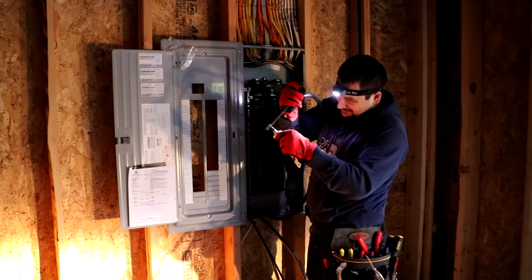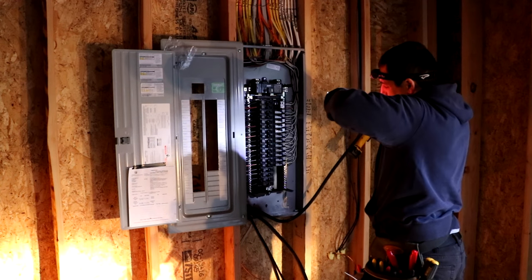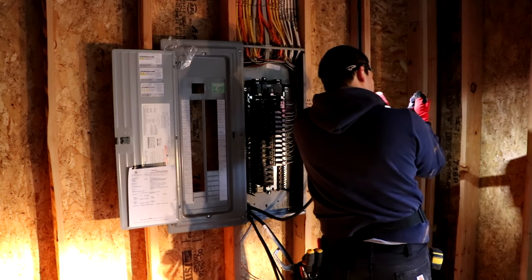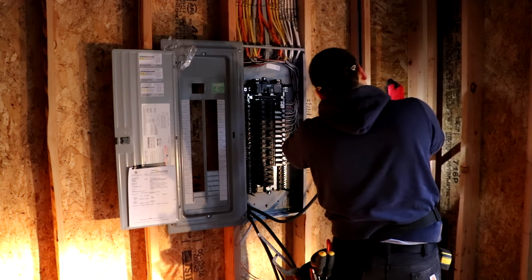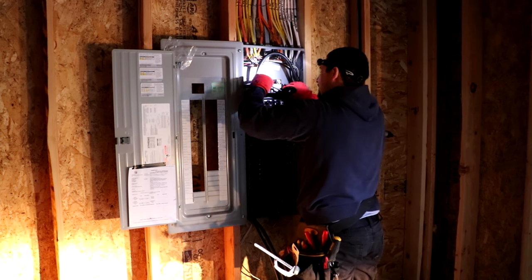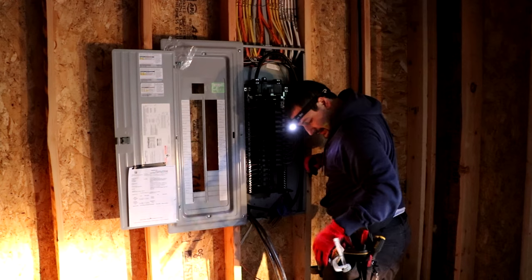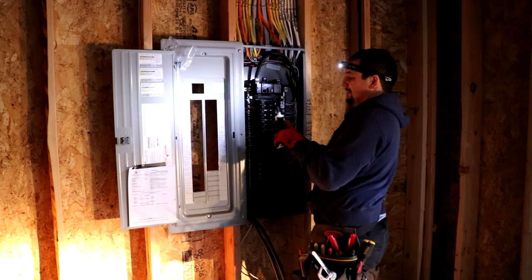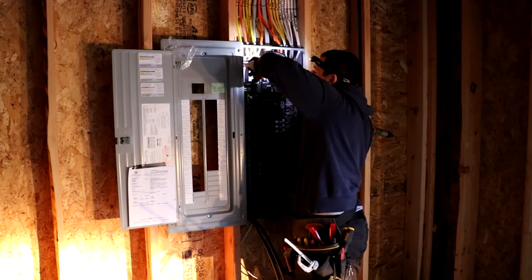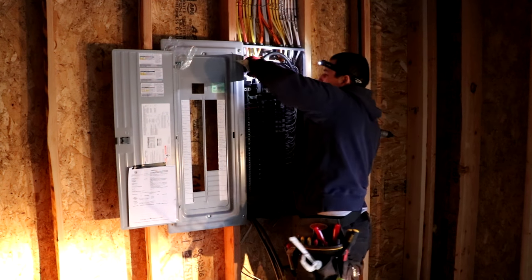I also put some on the end of the wire to make sure you get a good coating all the way around. You don't want oxidation forming, like you sometimes see on a car battery. You don't want to over-tighten these, but you definitely want to make sure they're really on there so you don't have any issues with the cable slipping back out later. I also take a little more of this stuff and goop it on around the terminal up here if there's any wire sticking out — just prevents oxide from building up on the aluminum wire.